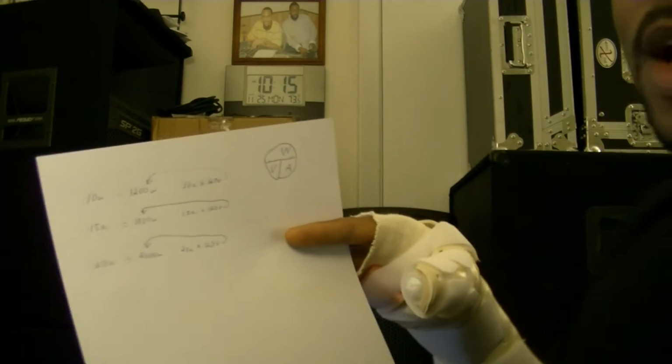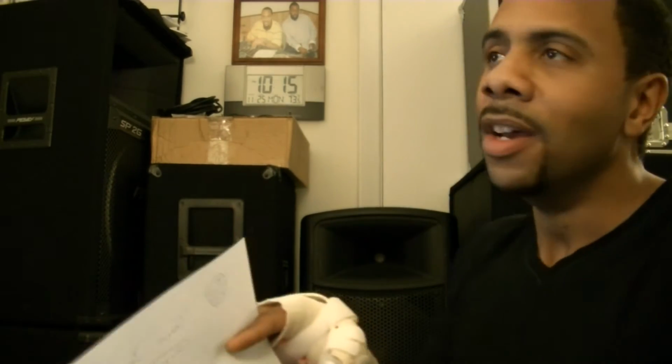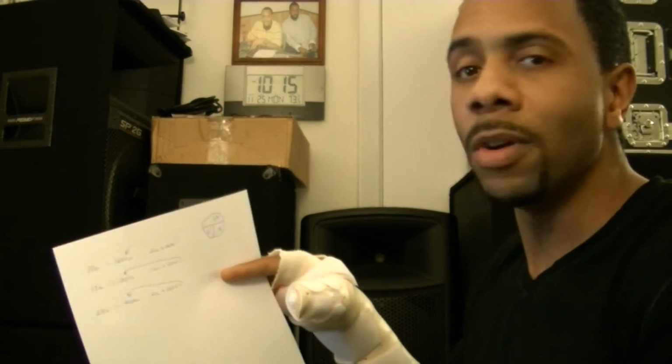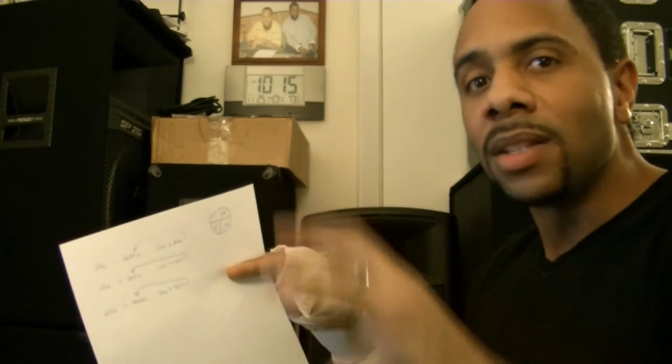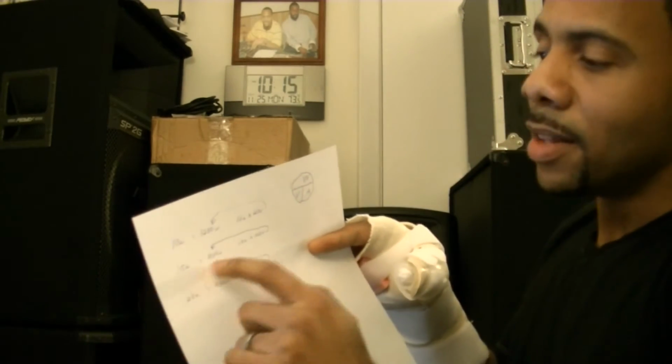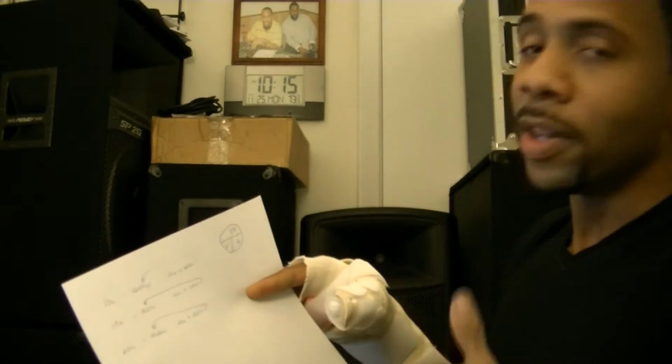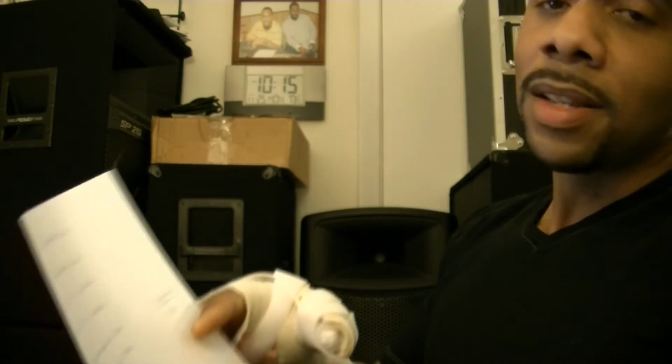It's almost like you're in one bedroom in your house, and you're plugging all your gear into one outlet in that bedroom, because most bedrooms have one separate circuit. So you can plug everything into that one circuit, start bumping it up, your lights and all that stuff, and what do you notice? Sometimes your lights in the ceiling, or a desk lamp you plug in, might start blinking with the bass, because you're pretty much ready to max out that breaker. It's almost ready to trip out on you. If it trips, you lose power. So that's how I figured all this out.